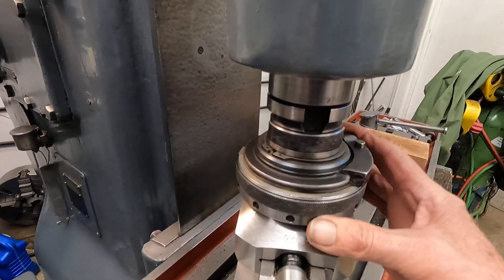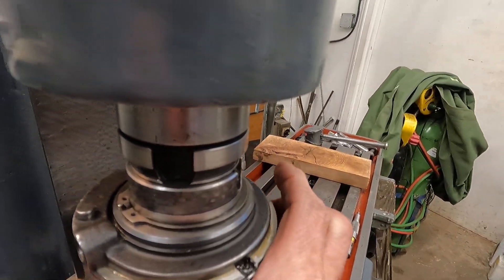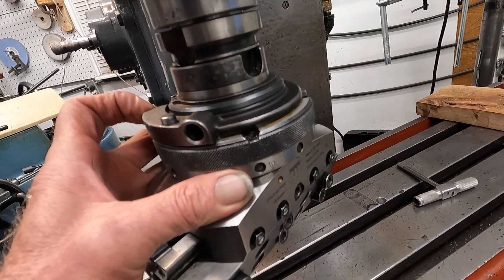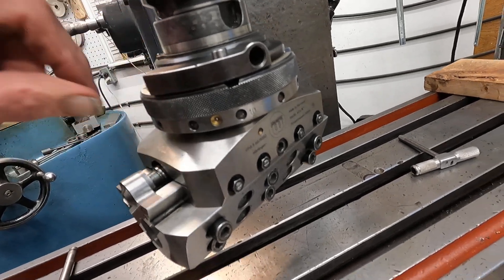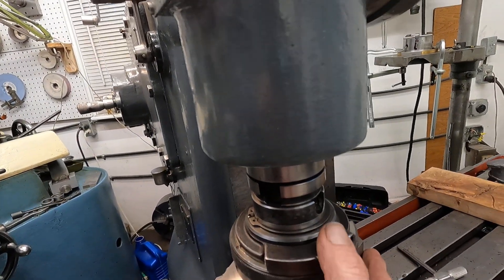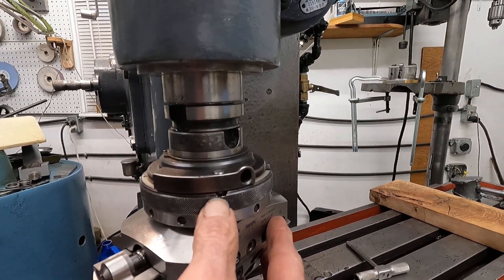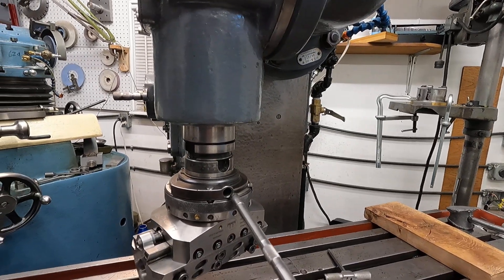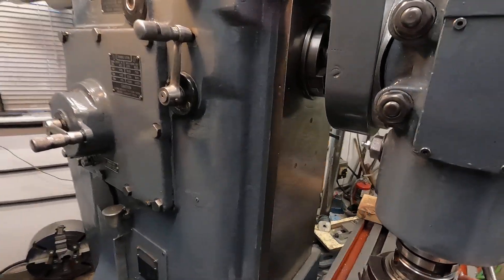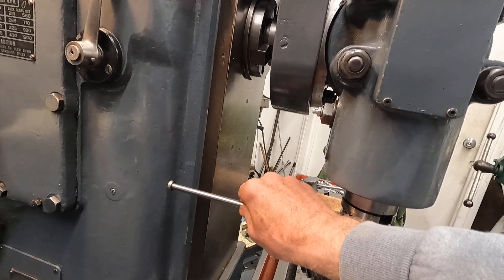One of the things I wanted to show on this head is the top collar. There's a notch right here, and this collar top part swings around. This pin pushes down — see, it pushed in, a good snap. And what that is, is a safety clutch. You put your stop bar in here, bring that around and bear it against the machine — that's a good spot for it, it'll just ride there.